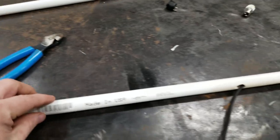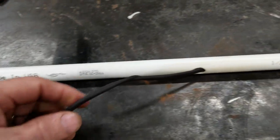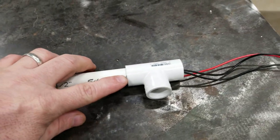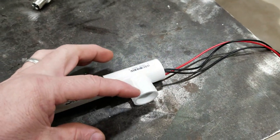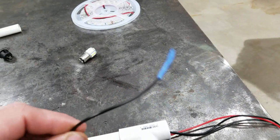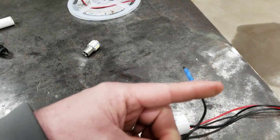Here's the bottom of the nav light — this is where my wire runs in from my box, hooks to my battery. I covered it with some shrink wrap to keep them together. It runs in here, comes up here, and right in here is where it splits the two ground wires — one positive. One of the ground wires is going to come out here and go to the switch. The ground wire you're going to split and send to the switch, I mark it with a piece of tape so I know which one it is when I start wiring my lights up later.